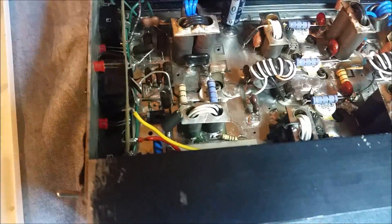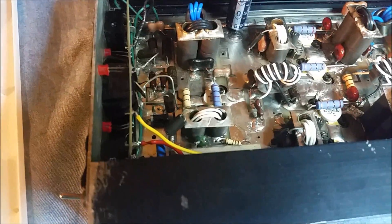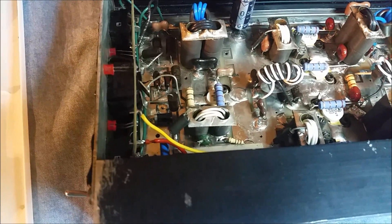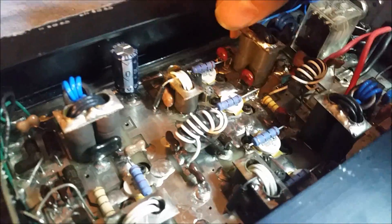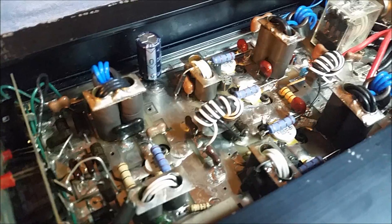There are just a couple of things in these amps that I would have personally done different. The driver section is one of them. The output transformer has no leakage capacitor — no capacitor from collector to ground. It does have a feedback circuit by factory right here, and I just put a new one on there to match the other, but the output has no feedback.